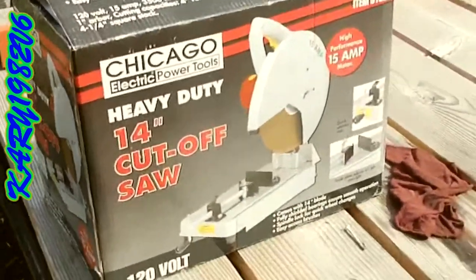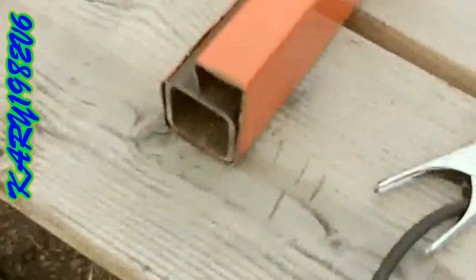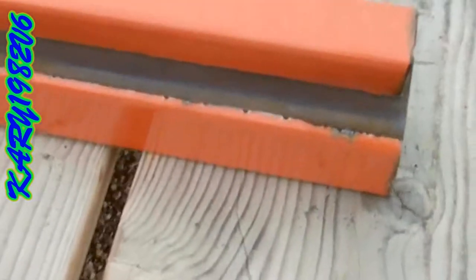This is relatively inexpensive. So this evening I went around and cut off four of these at one foot long. They're going into the end of here — this is going to be the receiver side. I had to notch out this area because it came down and then over, so I notched that out and slid in that 12-inch piece, which will be where the trailer jack receiver slides in.